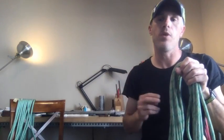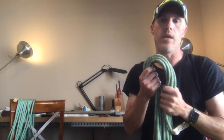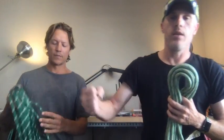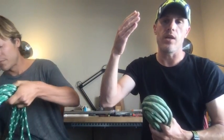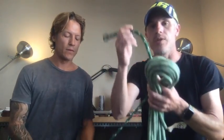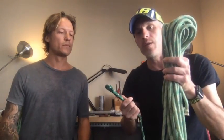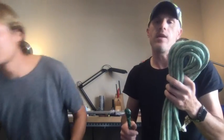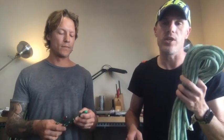So 2 big things to remember as a cruising sailor, if you want to upgrade to Dyneema. If you're going to use it as halyards, say you pull up your main, crank it in with the winch and set it, the line isn't going to stretch and the luff of your sail is not going to loosen up because of line stretch nearly as much as with what James just grabbed, your New England Rope Stay Set, which is an inexpensive, good rope, but stretches a lot more than the Dyneema will. So with your jib halyard or main halyard, you get the sail up, get your luff tension, and don't have to adjust it maybe a little bit, but not 5 times an hour because of constant stretch.